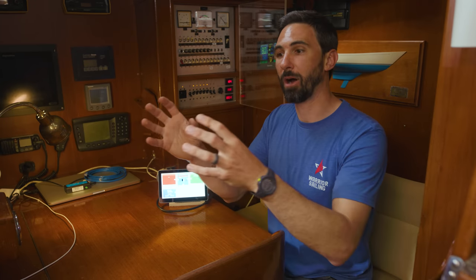So that was a view of battery bank sizing, but that's very simplified. Every situation is going to differ — you may have lots of solar, or a catamaran with lots of solar power, or a twin engine vessel with a lot of alternator power, or maybe you're generator heavy. It depends on your situation exactly how big your batteries want to be. Maybe you want to sit at anchor quietly with no solar for three days. This is the bare minimum — you need to apply it to your own needs, how you primarily want to recharge the batteries, and then figure out your exact bank size.